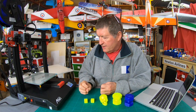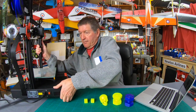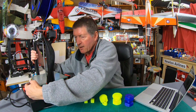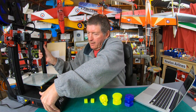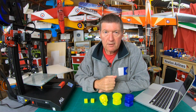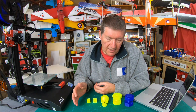Let's try a print — I've got a little one-millimeter ring loaded. We've started the print and it's heating up now; it does heat up quite quickly, which is good. While we're waiting, something else I've done: you can see I've wrapped up this connection here because there were bare unprotected wires hanging out of the plug. I've given that more support with tape and heat shrink so it's not flexing so much with every movement of the bed.